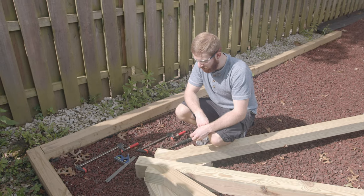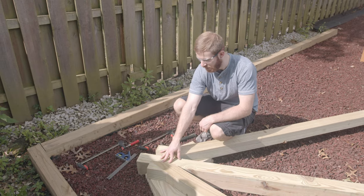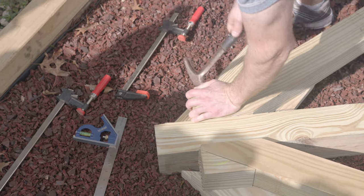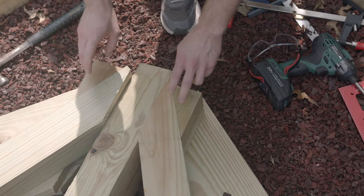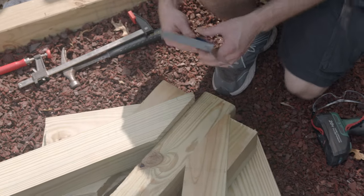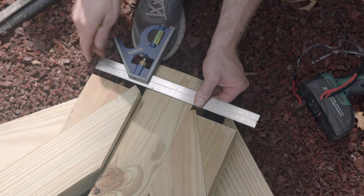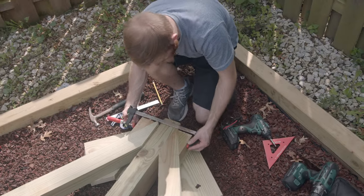So to build our A-frame, we need to reference this 4x6 because the 4x4s are going to rest up against the sides. And to do that, we just have to take our cutoffs and nail them on the side so that we can clamp them together. Once you have those in, you can go ahead and start making sure that they're the exact same height. Mark a line to reference if that works for you better. Then once we have them lined up that way, we can go ahead and clamp them together.